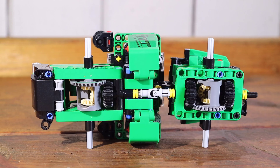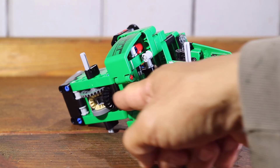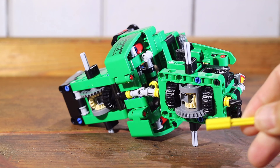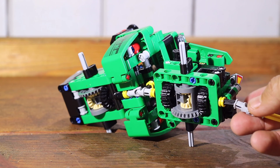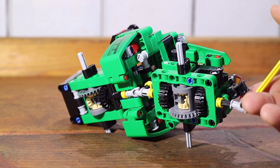After the rear differential there is an additional pinion gear and axle for the PTO. A tractor PTO is a power takeoff. The PTO allows torque to be transferred through the drivetrain to the end of the tractor where an attached implement or separate machine connects to it. Although I have not yet built an implement to attach, here's a quick demonstration of how it would be done. Using a straight axle connector piece would be the easiest way. A universal joint can also be used — the advantage being that the axle for the PTO could swivel side to side with the trailer hitch.